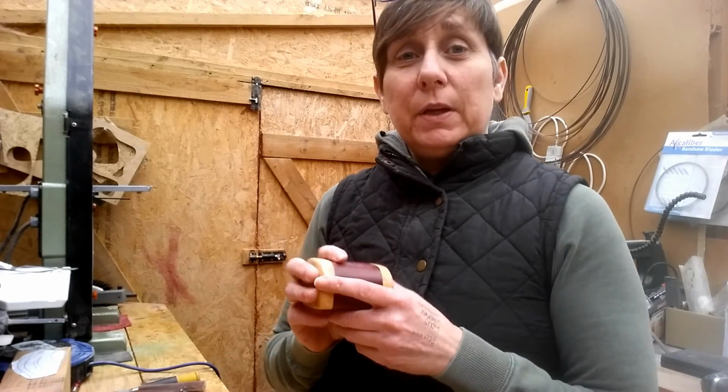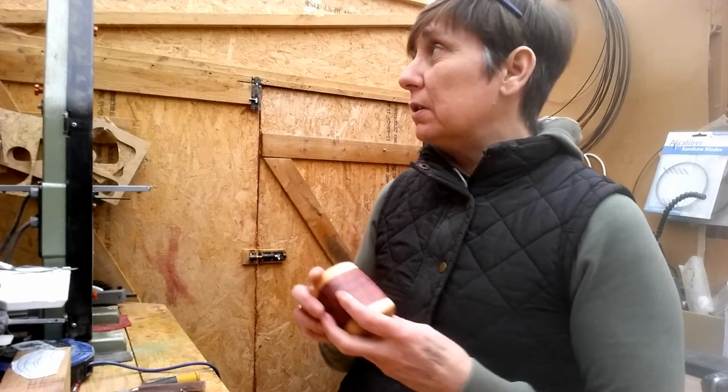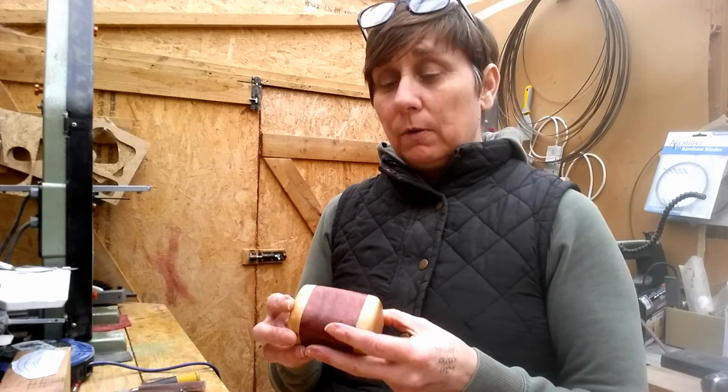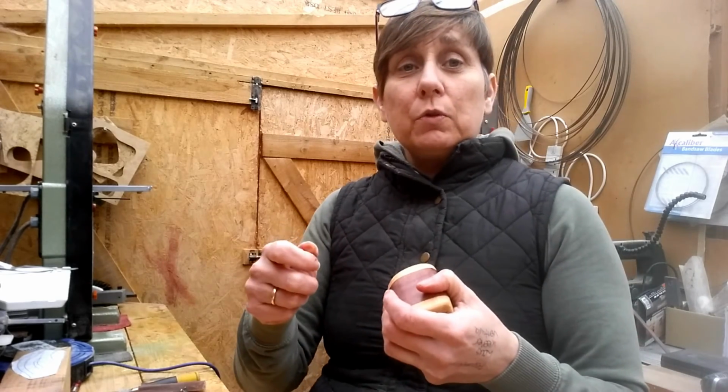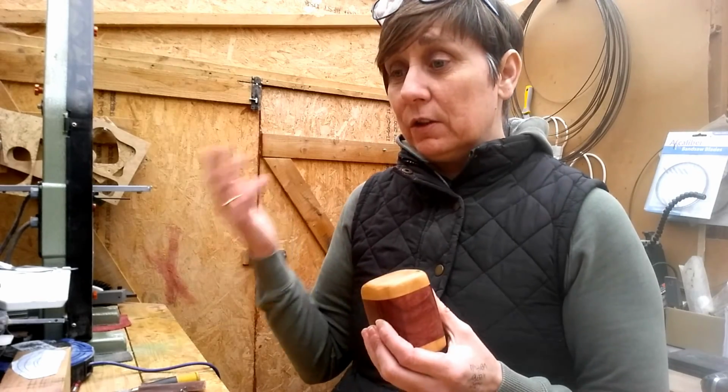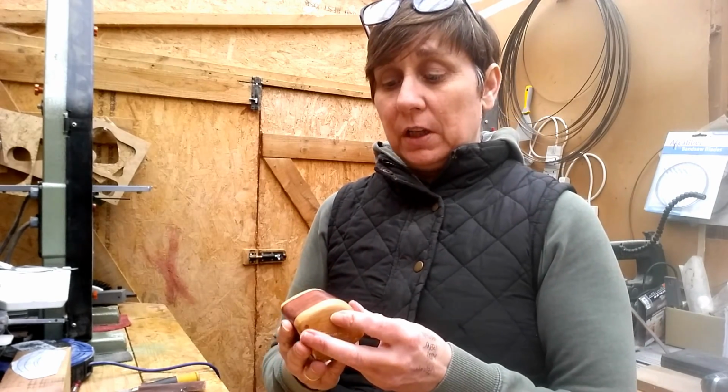I always do a test piece once I've set my bandsaw up, because getting the tension right is something that you just learn as you go along. I usually push a piece of wood through it, and if I can get it round, say, the tip of a cigarette, just twizzle the wood round, and if I get it round okay, the tension on the blade is fine for me. I've no miraculous way of sorting that out. I just tend to know that it's at the right tension.